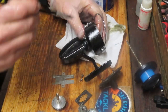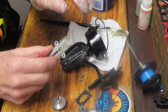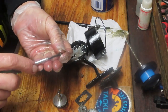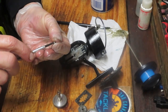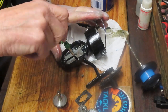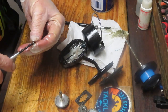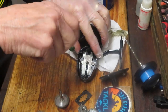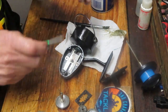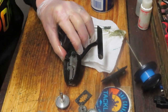Continuing along — it's kind of the reverse process now. A little bit of grease into the channel; grease anywhere else is just a waste. Put the slide in — there's a U-section that faces up top. Wind that in. We've got two of those little screws — I'll use my screw starter here. Start one side, then grab the other side. I'm going to switch over to a regular driver. Yours might have a hex on it; if so, you can also use a small socket.